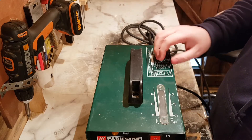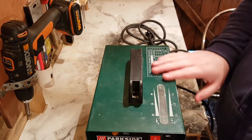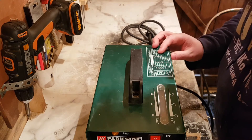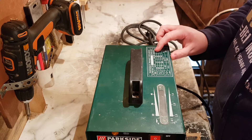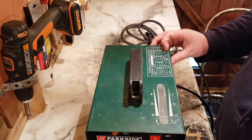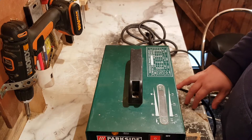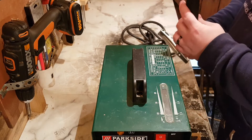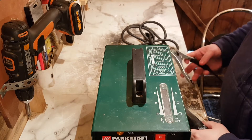It's just a big transformer inside — that's all it is. The transformer decreases the voltage and increases the amperage. At 40A it's 19.6V, and at 80A it's 21.2V — it drops the voltage right down and brings the amperage right up. It's got a dial on the front to wind it up and down, an off switch, standard ground clamps and electrode holder. There's nothing else to it.